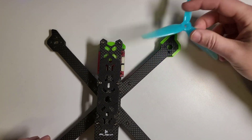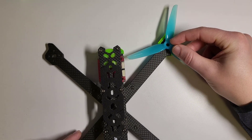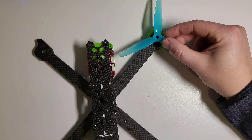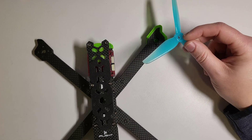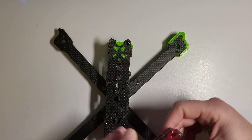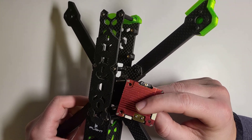The VTX does not touch the props — and of course it's normally going to be elevated anyway. But just to show you in the worst case, there's no way that the propeller can hit the VTX. And if it did, I can assure you this VTX would take the hit — from personal experience, not from a propeller but from a tree. The other option is to mount this VTX on the center stack, like I was showing on the footie frame.